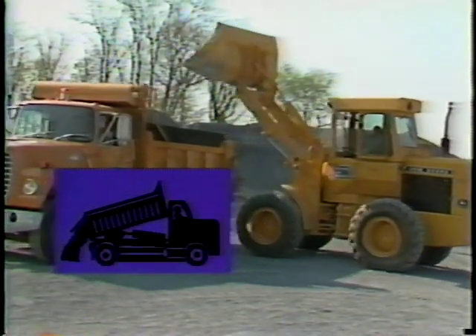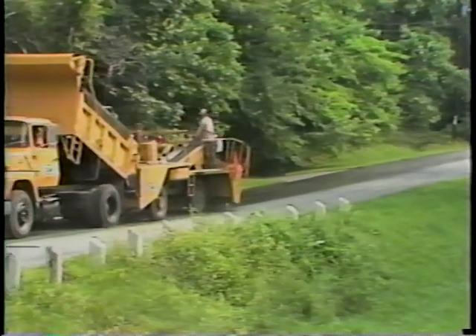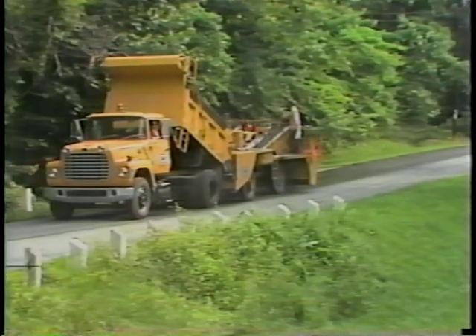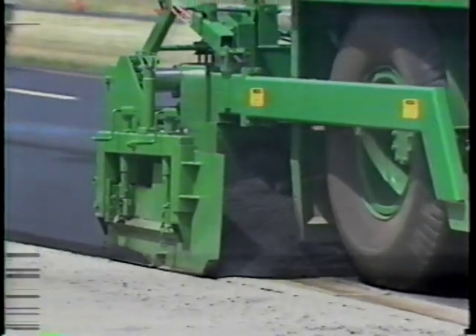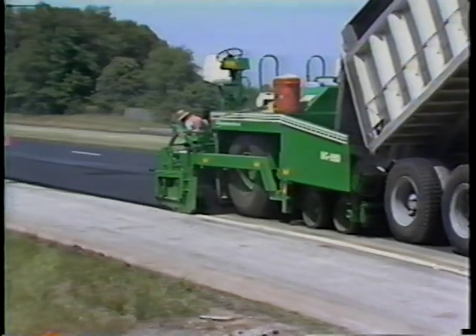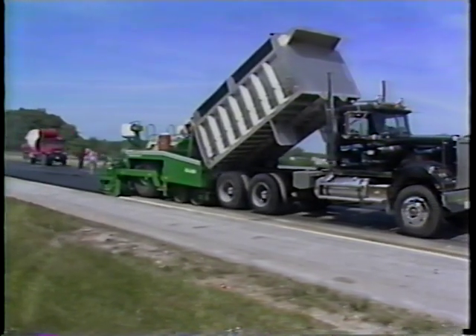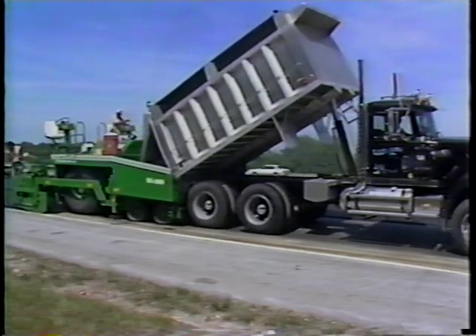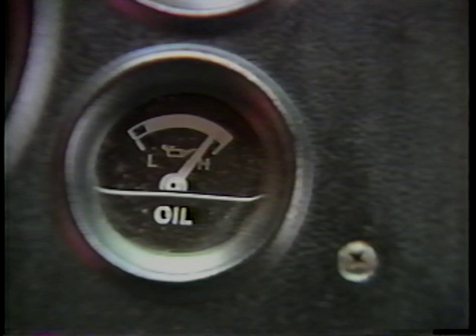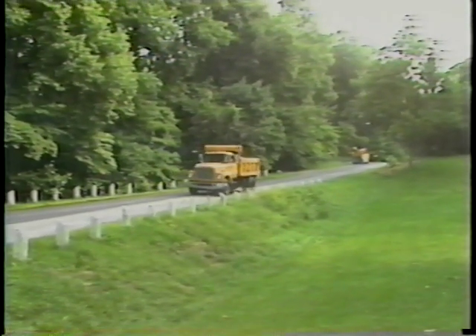The third daily maintenance activity, the daily operating check, is carried out during daily use. As you perform your various tasks, don't forget these daily operating checks. During operations, you should listen for unusual noises, read your gauges, and be aware of any changes in the performance of your truck. Listen to your engine and powertrain — do you hear anything unusual? Do you feel any excessive vibration? Any unusual noises or vibration would normally indicate a mechanical defect that could be causing serious damage to your truck. Are there any noticeable changes in the performance of the truck or the hydraulic hoist system? Read your gauges constantly. Watch pressures and temperature closely. If any gauge indicates a problem, stop operations and inspect the faulty system. If needed, notify your supervisor.